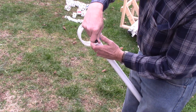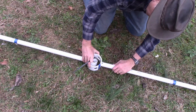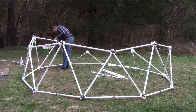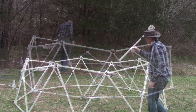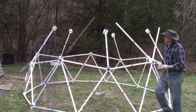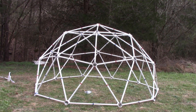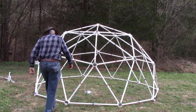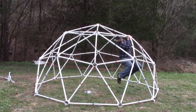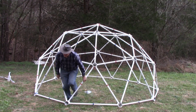So let's look at the same dome with the same center rings and the 120-pound zip ties, but this time built with the addition of the locking collars. This dome is easy to build from the ground up since the locking collars hold the struts in place as the dome is being built. This dome is built with the same type of 120-pound nylon zip ties as used in the first dome. I weigh over 240 pounds — will this dome support over 240 pounds even though it is only held together with 120-pound nylon zip ties? The answer is yes, as the locking collars more than double the strength of the 120-pound zip ties.